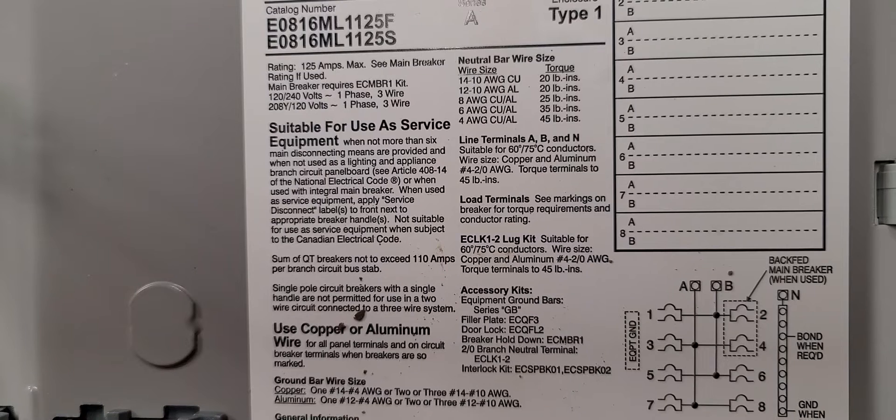So inside that home — and we'll say in this scenario — used to be your first point of disconnect, you had your grounds and neutrals bonded together. Some equipment is suitable only for use as service equipment, meaning that you can only bond the grounds and neutrals. They cannot be separated, period. Doesn't matter what you do — it's only suitable for use as service equipment.